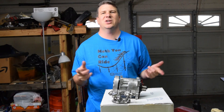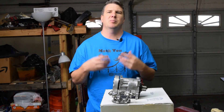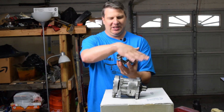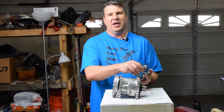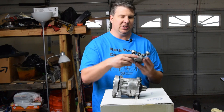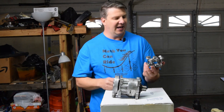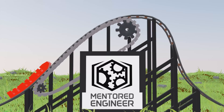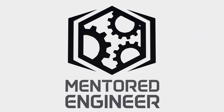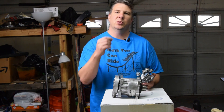Welcome to The Mentored Engineer. In this video, we're going to be talking about piston pumps and, to a lesser extent, motors. Piston pumps are pretty cool. They're all going to have some sort of this arrangement in there. These pistons are going to move around, going up and down in a cavity, and that is going to provide fluid motion. Or in the case of a motor, we can turn fluid pressure into rotary motion.